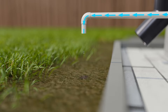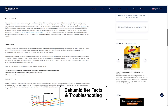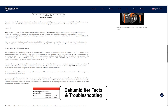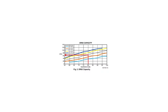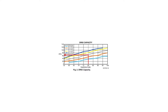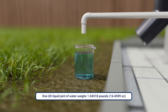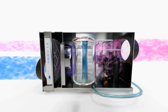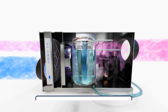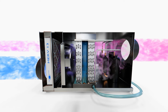Henry Garcia talks about this — he did a tech tip back in 2018 called 'Dehumidifier Facts and Troubleshooting' on HVAC School. If you type 'dehumidifier' in the HVAC School app or hvacrschool.com search bar, he really talks about this. As an example, if you have a system operating at a nominal capacity of 65 pounds — which is about 65 pints, since a pint's a pound the world around — 65 pounds of condensate in 24 hours equals about 2.71 pounds per hour. So collecting condensate in a measuring cup, it should produce about 14 ounces in 20 minutes. The problem is you have to know the p-trap was completely full, the pan was already overflowing, those entering air conditions stayed the same the entire time, and the dehumidifier was running the entire time. That makes measuring condensate kind of tricky.